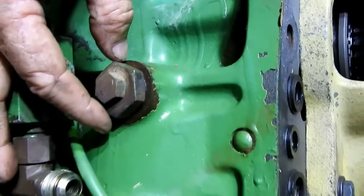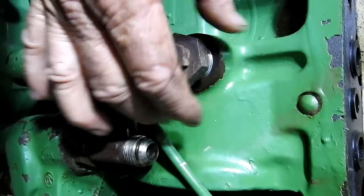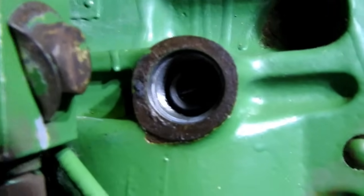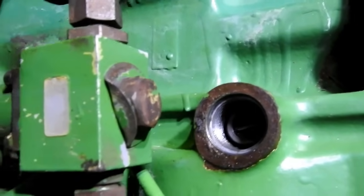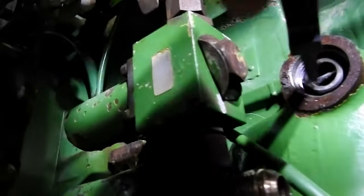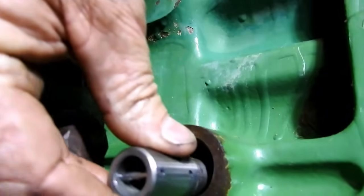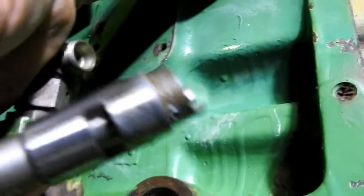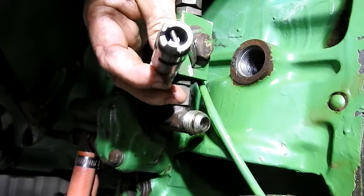You have this valve here. Now an inch and a quarter AF spanner fits it. You'll need to drain some oil out of your tractor. If we undo this valve - inside there, can you see that? No, barely - you can see a little valve with a roll pin across it. So you can hop in with some pointy pliers and pull that valve out. Once you've got that valve out, there's a couple of things to look at. Let's go over to the bench - now you know where the valve is, we'll go over to the bench and run through how it works.